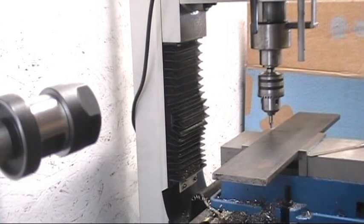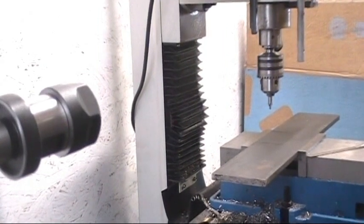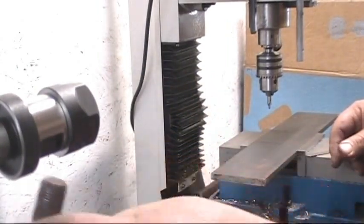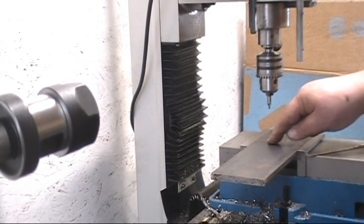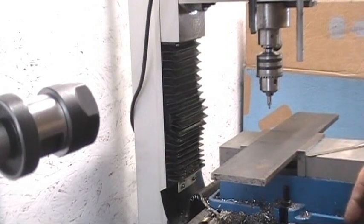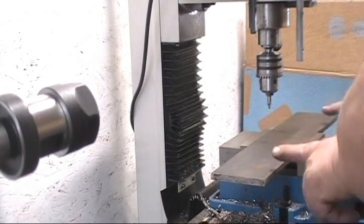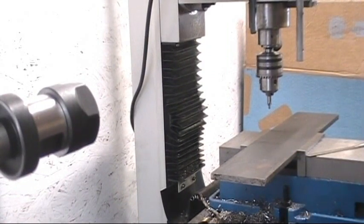It's about a 5/8 hole, or three quarter. And the bolt, which I'll show you the bolt, a little old pipe thread. Looks like it'll be a 5/8. That's what goes in these two holes here. I'm moving the spring plows in here, and I'm bringing two from the outside in to here, which will group them a little tighter together. It's going to cut about a 14-inch groove, which is good. It's a lot better than what it was.